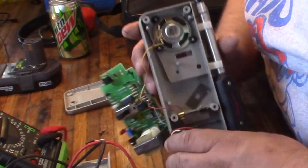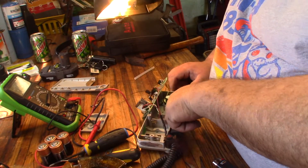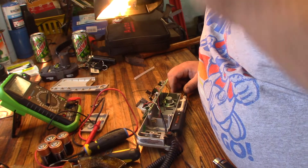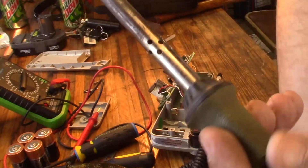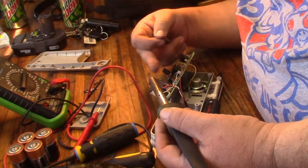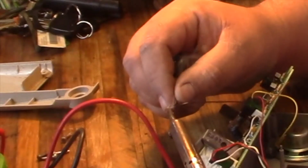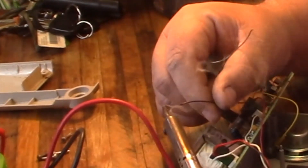It's just gotten corroded back in here. I'm going to solder my black wire right back on there. I've cleaned this connector off really good, and I've got my solder and iron out — this is my little cheapy car one that I keep out here in the garage. I've stripped some wire back. This wire is really cheap aluminum wire, it's not copper, and it's really oxidized. We'll see if we can get her to take some solder.